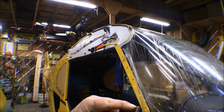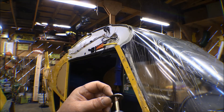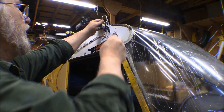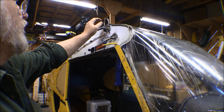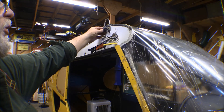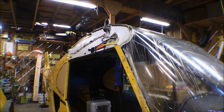You're supposed to have at least two threads protrude through the elastic or rubber on the end of the nut for it to be proper. There are enough threads for an AN365 nut to go on there, but just barely — it might not have quite enough threads going through. So that doesn't quite work. I don't have any longer bolts that are the right size; I have AN5-25 bolts but those are quite a bit too long. The ones that were on here originally made up with a bunch of washers, but that gets kind of sloppy. So I've ordered some new, properly sized bolts. It'll be a few days before they get here. We're on hold for now, but got everything else pretty much ready to go.